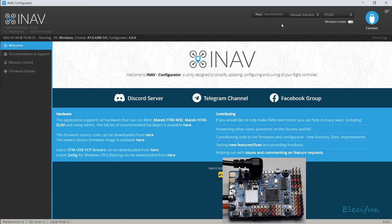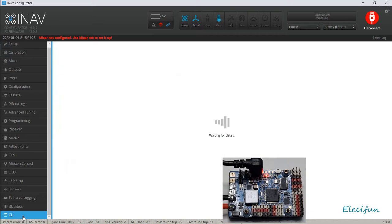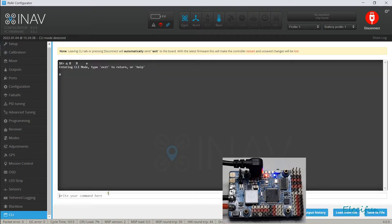Right, guys. So what we're going to do now then is put the software onto the board. So we're going to put the firmware on, I should say, onto the board and use INAV. Now this is just going to bring us in. We're going to just check COM6. Good, we're all good. Now it doesn't look like it's got the gyro and accelerometer configured, so I must have some information for that somewhere. But I'm just going to go into the CLI and I'm going to do this